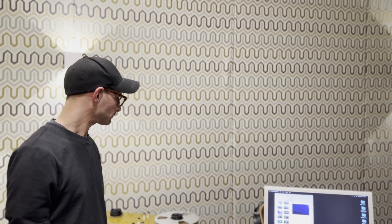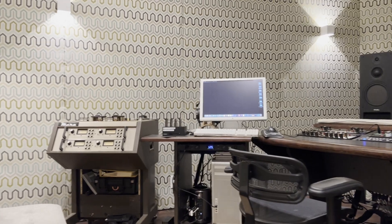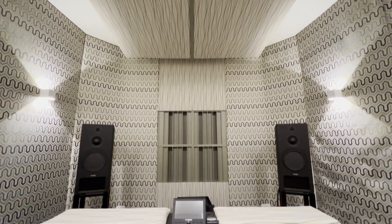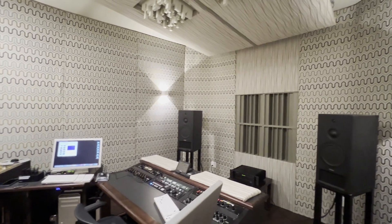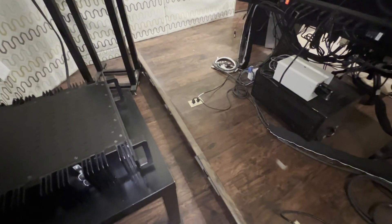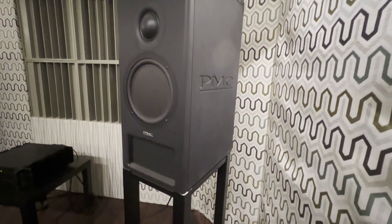So this is built in a garage, and you built basically a room-within-a-room using smaller studs — the smaller stud that's recommended for recording studios. The room is actually slightly trapezoidal — about a little less than five degrees of incline inward toward the front. Everything is sort of floated; the floor is floated. The only contact with the garage foundation is the speakers — they sit directly on the smooth concrete garage slab, while everything else is isolated. And I actually think that has made an impact on the clarity of these speakers.